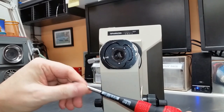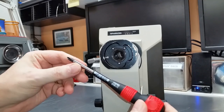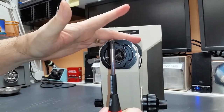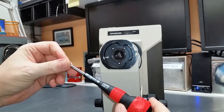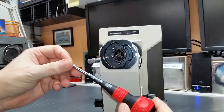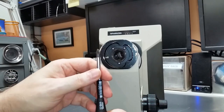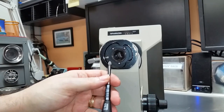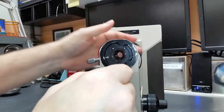If you've been watching the other videos, you'll know that I'm pretty adamant that you should not be using just any Phillips screwdriver on these Japanese scopes. The screwdriver I have here is a Vessel P1 75mm long — essentially a Vessel P1 screwdriver — and it is compatible with JIS screws, which is critical on these things. So let's go ahead and remove the three screws.